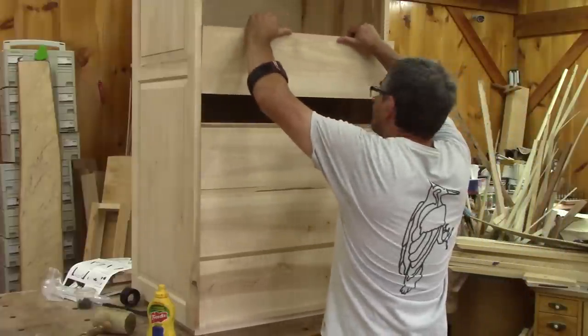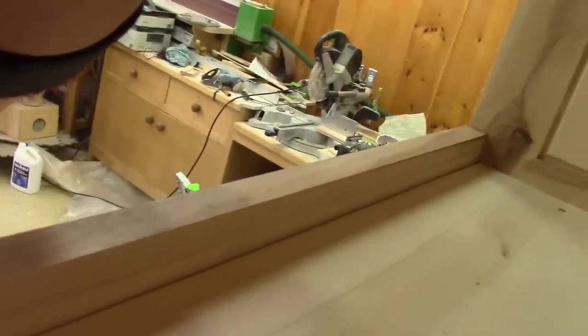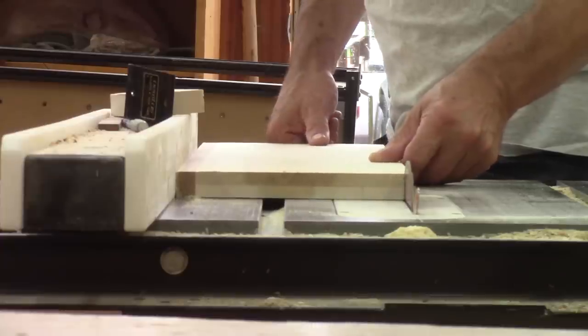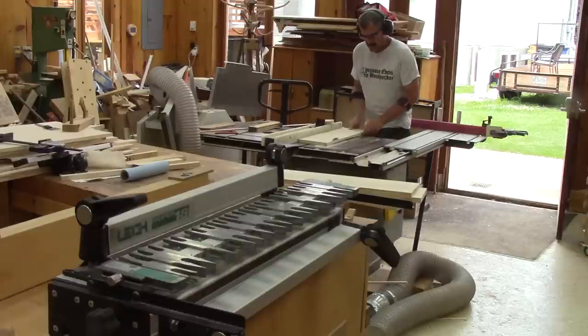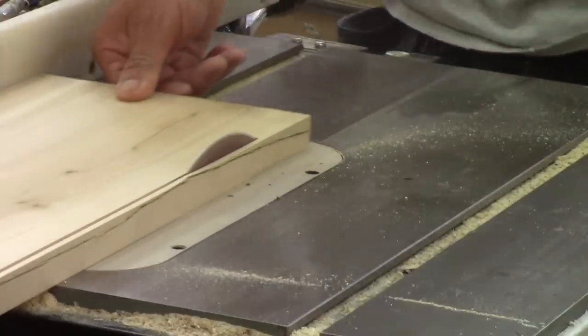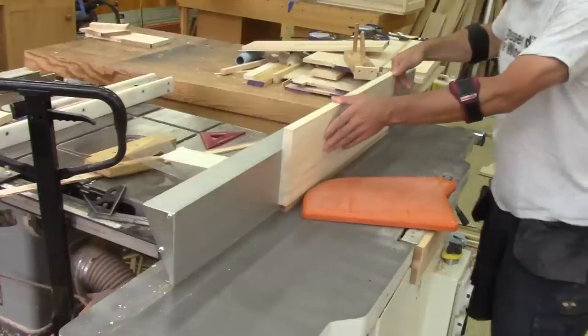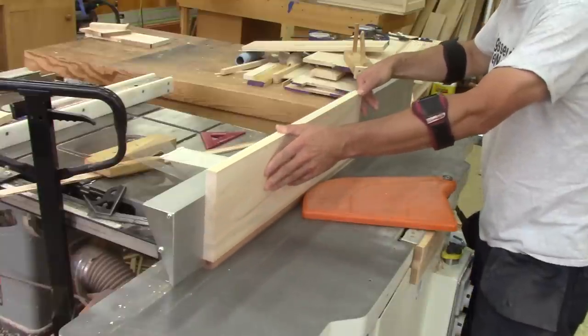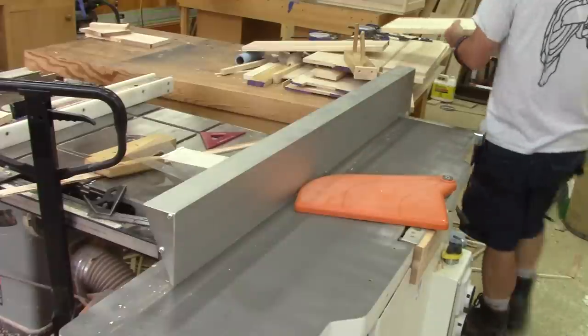This is a taste of what this will look like. But the apple wood I've added makes this too wide, so I need to remove some wood. This is perfect — it has exactly the same height as the central fixed shelf. But I want a gap, so I remove a bit of wood on the jointer. With this, I'm sure everything is straight.